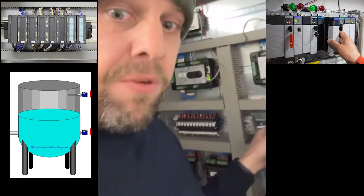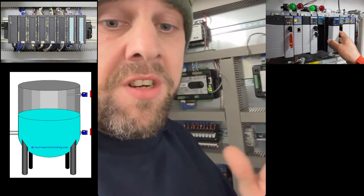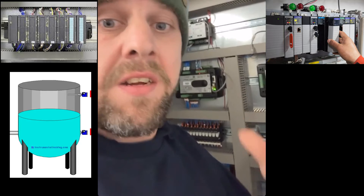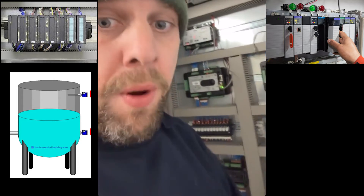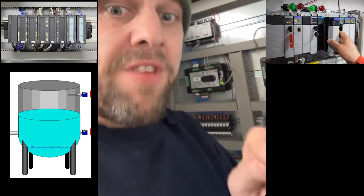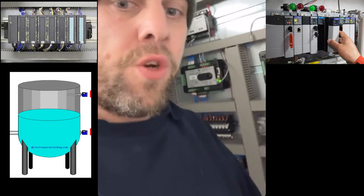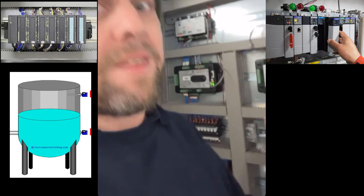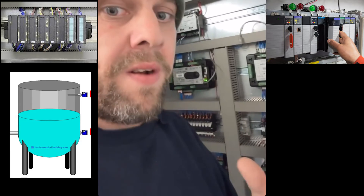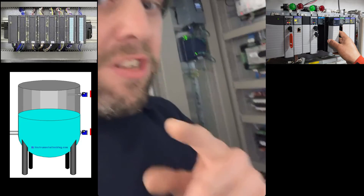The computer could read a temperature sensor and display ambient temperature from minus 10 to plus 50, and your fan could run proportionally to that temperature to move air at different speeds to maintain a setpoint. When you have an analog input and an analog output in relation like that, it's called a PID loop — I won't go into those today, but Google it if you want to get more advanced.